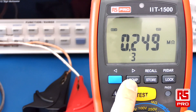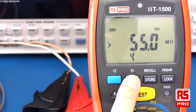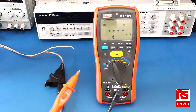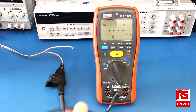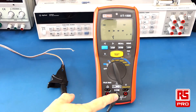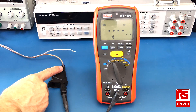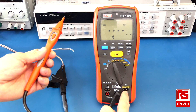The blue function button and the comparison button with the two arrows will allow you to browse through any other readings saved in memory. To perform insulation tests with the supplied remote probe, simply install one of the test leads into the common connector to connect to your wiring point or switch under test, then install the remote connection probe into the special connector.